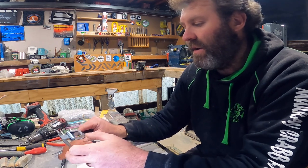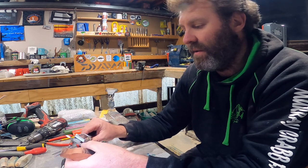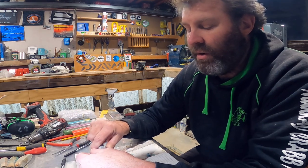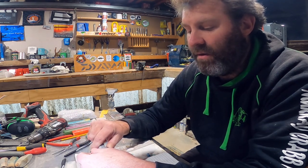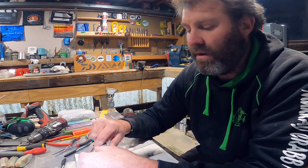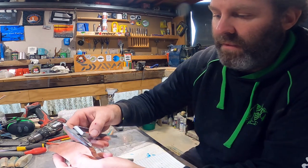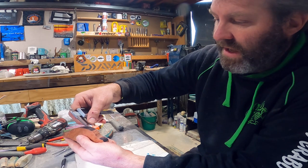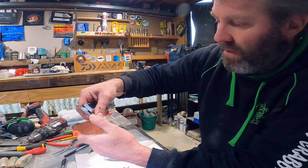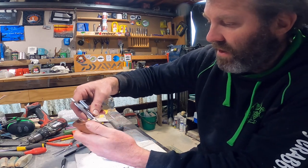So if we're at, say, 20.6, we're at 10.3, let's go 10.25, and you're on 0.01, 0.02 of a mil. It's really easy to go overboard. 10.26, that'll do us. All you do, sit your calipers like that, so they're just off the side, and score yourself a line. All right, that line is now what you'll do everything for your lure off.